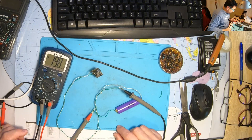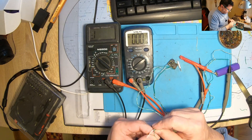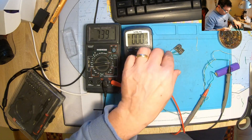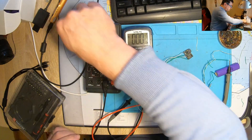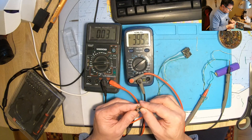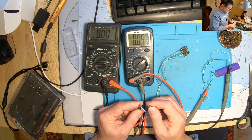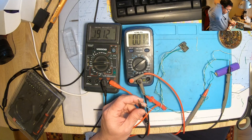That's the output wire. 20 volts. Let's power on — we have 7.38 volts. Let's put it higher, let's say 18 volts. Now watch what happens if I just short these outputs. And it recovers. This is very, very nice — it's getting a little bit hot, of course.